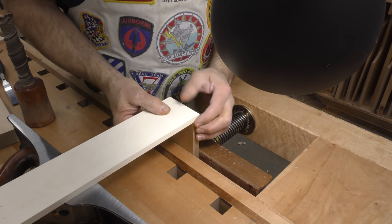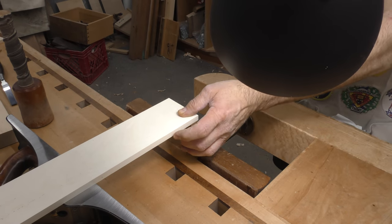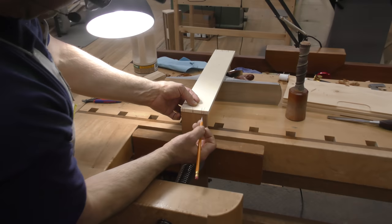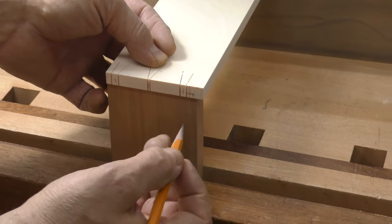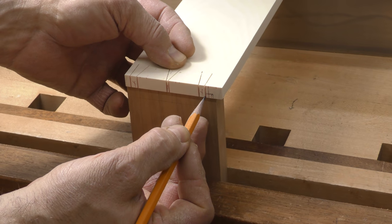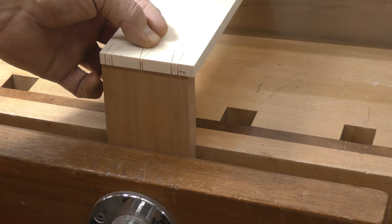If we do it on the top, in other words, measure it from this side, we still have to cut material off the bottom. Come back here, Jake, please, over around here. So when we build our drawer, there's where the groove is going to sit, right here, right at the bottom of this pin. So the drawer back is going to be cut off right here, because the drawer bottom slides underneath the bottom of the drawer back.